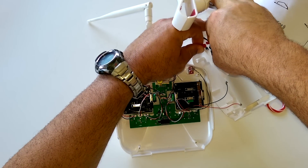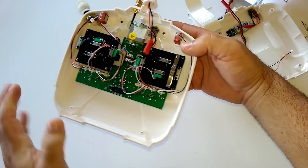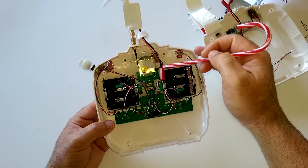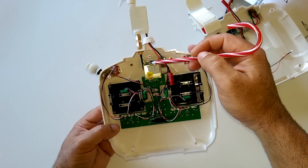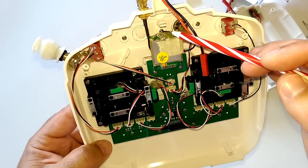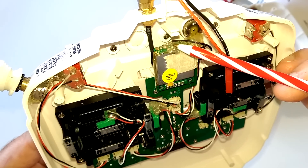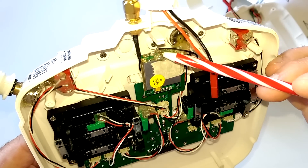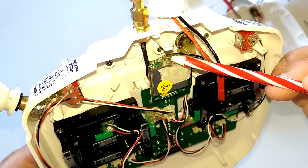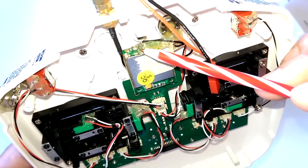Once you have it open, looking at the insides — the actual amplifier, the 2-watt amp, comes with its own antenna, its own antenna extension wire, its own lock nuts, and a little length of extension wire that you're going to be soldering onto the antenna board itself. As you can see here, I've soldered it into the board. It's basically just a mini coax cable. You do this by unsoldering the old antenna — I think it's a 3 dB gain antenna — unsoldering the shielding onto this glob of solder, and then the center conductor goes here onto this portion.